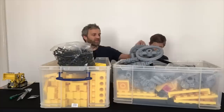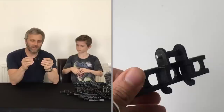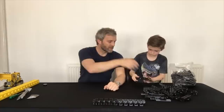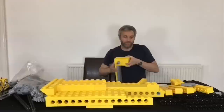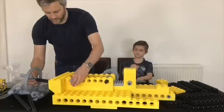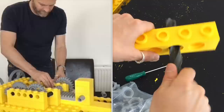It's quite a lot of stuff — I'll put these back on the floor, it's too much to put on the table. I want to get Reuben starting to build the tracks, which he's already dug out. These are 3D printed but they do have a metal pin that goes down through the middle just to add strength. Here I'm using a 24mm drill bit just to clear out the holes so that the axles run more smoothly through them.